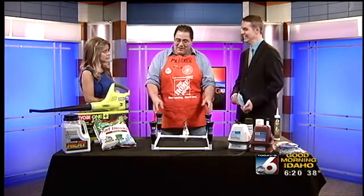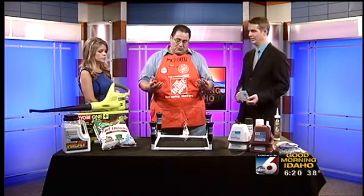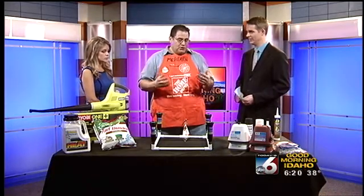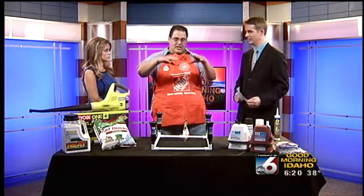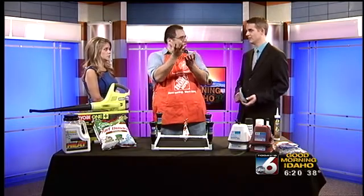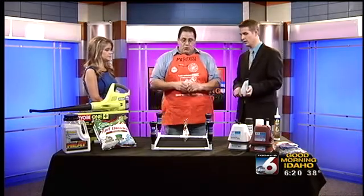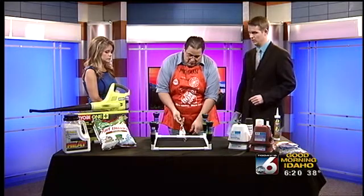The first year I was here, they told me to blow out. Where I came from, you don't blow out sprinklers. It's not necessary. So come springtime, when I turned on my sprinkler system, the water was shooting out. But when I went out later on, I had two bubbles in my lawn where the pipe had broken, and it was lifting my lawn. Because that ice is going to expand and crack your pipe. Yeah. So you really want to do the blowouts,